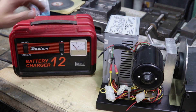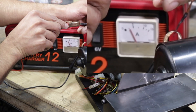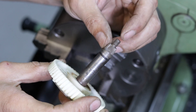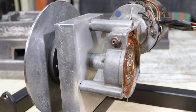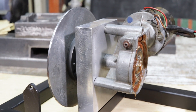The one big disadvantage is that they are going to need a dedicated DC power supply to run them — I recommend something in the region of perhaps 5 amps. The two biggest downsides to using a wiper motor is that they only have splined and tapered shafts, which are difficult to adapt to, and they have three weird mounting points which don't make life any easier either. But hey, that's what machine shops are for.